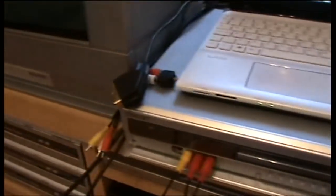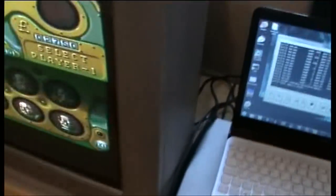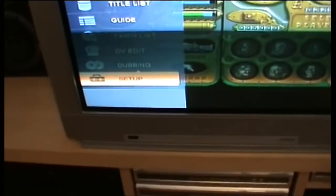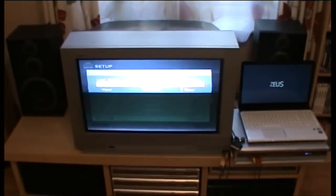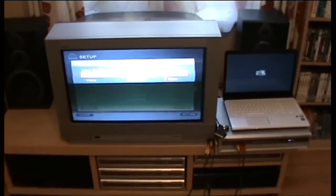I very rarely get the Amstrad out now. So that's really it — the problem is you need a DVD recorder where you can go into the menu, find the video SCART setting, and make sure it accepts RGB. If it accepts just video the picture will come up black and white. That's where most of you are going wrong. If the picture is coming through your television in color via AV1 — that's fine. It's the DVD recorder that's the issue, not your SCART lead.